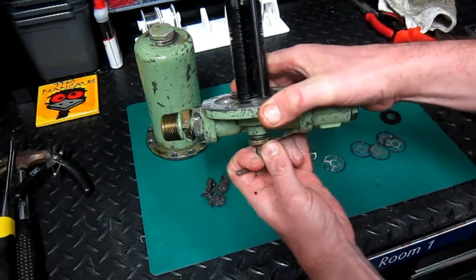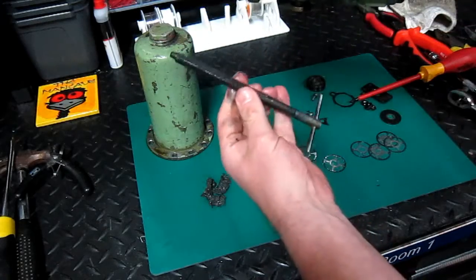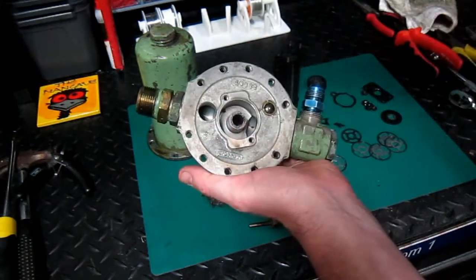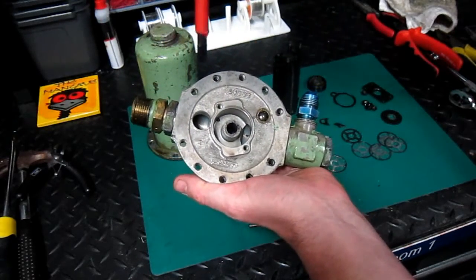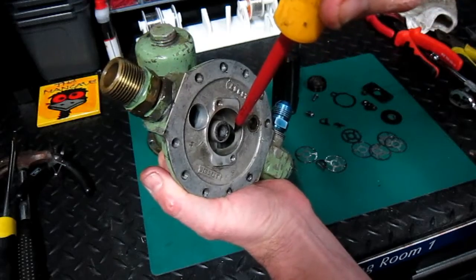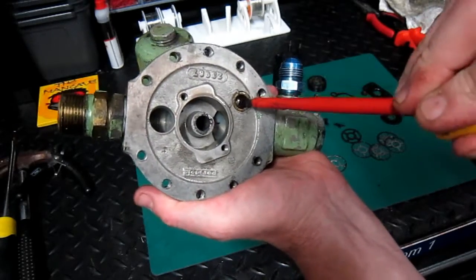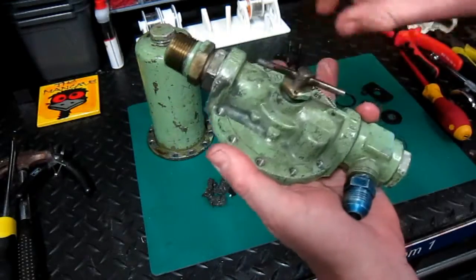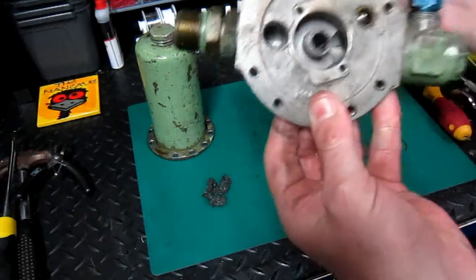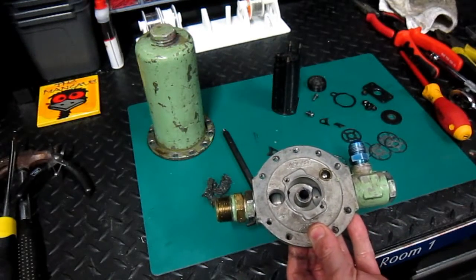If I remove this centre shaft now and take away this part - so the fluid goes through there, through the hole, fills the chamber under pressure. The pressure will force it through the actual filter and it will go down through this hole here and then exit through here. And again, we've just got this little pressure relief valve should the filter become blocked. But as previously described, the engineers every now and again would twist that through a number of rotations and that would actually clean the filter. So quite a simple design but as you can see, hundreds of parts to make up this filter.